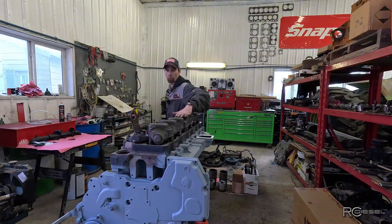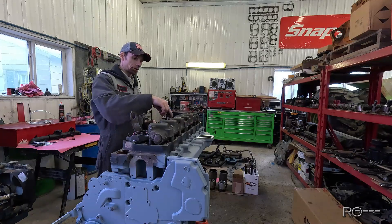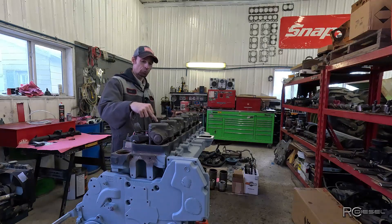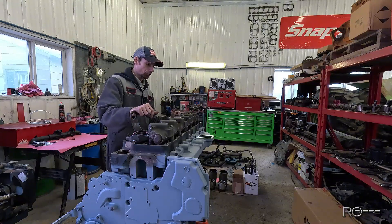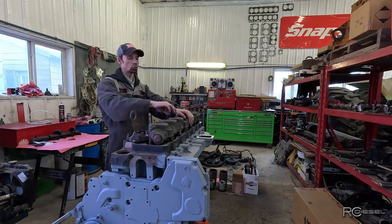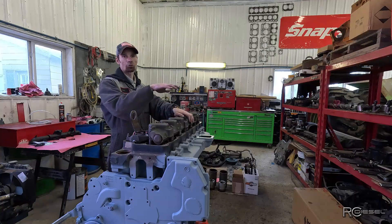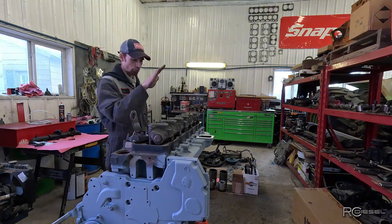So you saw me when I put this on here — what I was doing was tightening the bolts on the back half by hand while I was rocking it. I got it pretty tight that way but it wasn't wanting to seat right into those injectors, and you don't really want to pull it in with the bolts. That's always a bad idea because if you get any amount of force on those rings, it'll just pull them out of there and pull them back on those backup rings and O-rings. So what I was doing was wiggling it and just lightly turning the bolt in with a ratchet — just about could do it by hand but not quite. By wiggling it back and forth and working those bolts slowly while wiggling, it just settled right into those injectors and came on nice and flat.